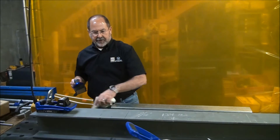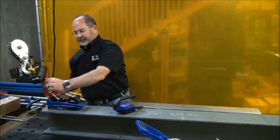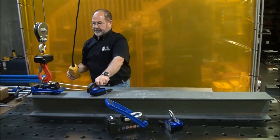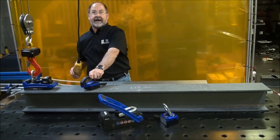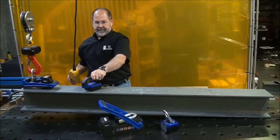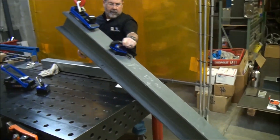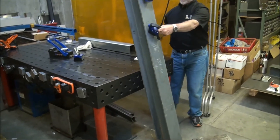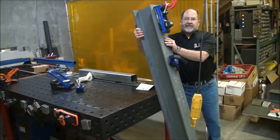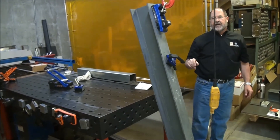I'll grab a hand lifter, make sure I've got good control over this piece as it's being lifted. Let's go ahead and hook it up to our crane. And of course it's going to try and swing until I get that crane directly overhead. I'm going to try and control the load with my hand. If the load gets out of control, get your body away first. In a test lift situation, I'm pretty comfortable — I've got enough holding force. We're bringing this off the edge of the table. At this point it's completely suspended in air. As you can tell, it's not 90 degrees because the center of gravity simply isn't there. If I was going to be moving this around the shop, I'd just want to do a test and make sure I know what I'm doing. One of the advantages of lifting plate and even pieces of steel like this I-beam in shear is you get a lot less tendency to flex.